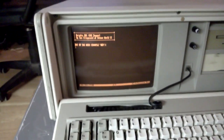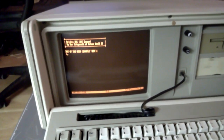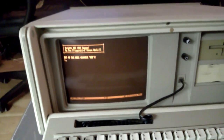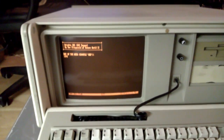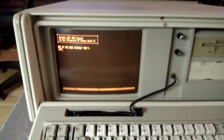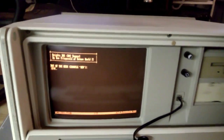And we're on. Now the modem handshake you heard after the BBS answered the call didn't sound like what probably most of you, especially if you're around my age, remember a dial-up handshake sounding like, and that's because although this has a 33.6K modem, which has a stereotypical sounding modem handshake, I've forced the modem to operate at 2400 baud because when I tried to dial into this BBS with the modem running at its full speed, it would not complete the handshake, and eventually the line would just drop. So maybe it's just a weirdness with the modem or with my phone line, I don't know.